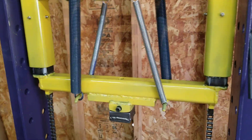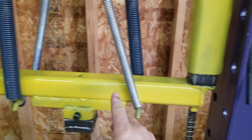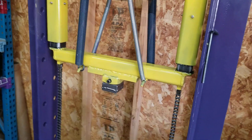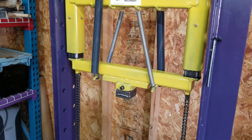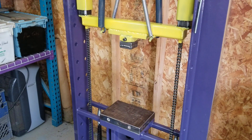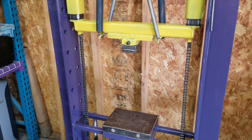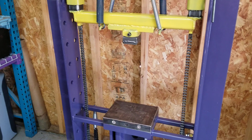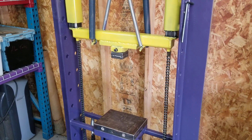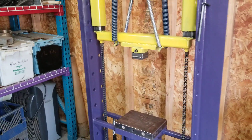The hammer itself - between the two two-foot hitch stocks, the crossbar, and the hammer part - is about 40 pounds. I was really hoping to get a one-to-six or one-to-ten hammer-to-anvil ratio as far as weight goes. That just didn't seem practical given the amount of abuse the machine would see. I could have certainly made the hammer part lighter but I don't think it would have lasted very long - it would eventually just bend and be a problem.